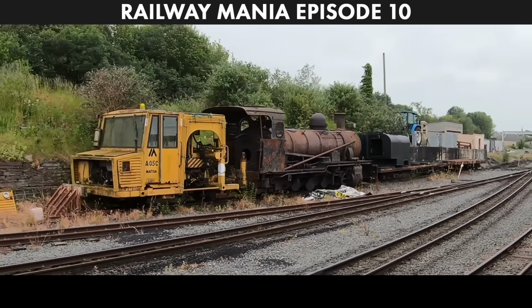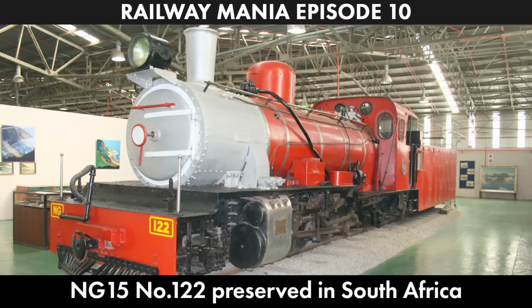is known as a KH truck. There is a name which I can't pronounce. Krauss-Helmholtz. Yeah, I refer to it as KH truck. It's a lot easier, and that influences the leading driving wheel into corners by a very, very clever ball and pivot arrangement. So it's a very interesting design.